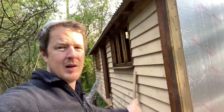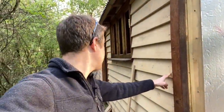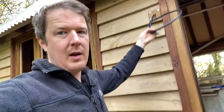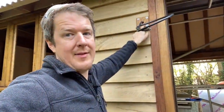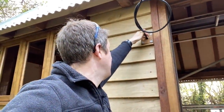On this side you're going to see the kind of finished effect. This is oak cladding that he's been putting on — it's like feather edge board, basically, but oak. He's boarded all this side yesterday and I must say it looks really really beautiful. We've got an outside light going up here, so it's going to be just like a little down-spotlight, industrial style, which he's made a nice little oak plate for. The only thing is it's going to be tricky terminating the armored cable into that, so I'm not quite sure how I'm going to do that yet.